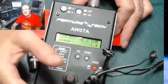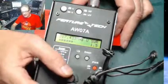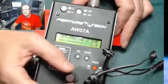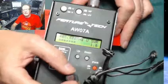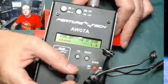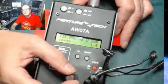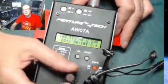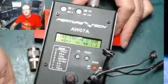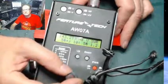If you get an output error on it, on every frequency on this thing, then that means the batteries are low. It'll work on HF, but it doesn't like VHF and UHF with low batteries. And it doesn't have a battery indicator on the front when you're in this mode either. So look, here you go. Quite acceptable. Put it to VHF, come back down. See? Nice. Tells you everything you need.